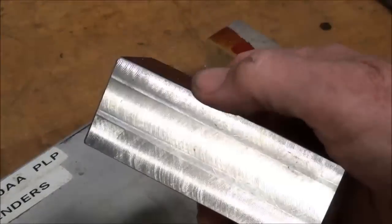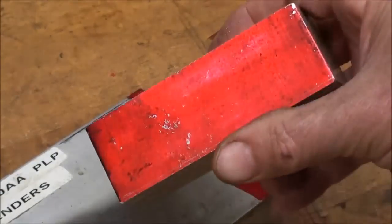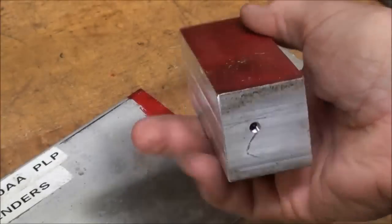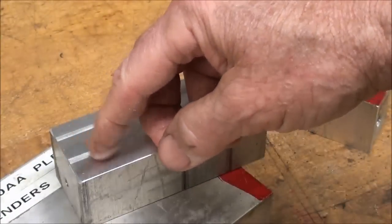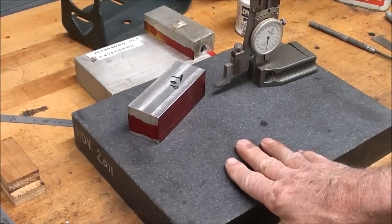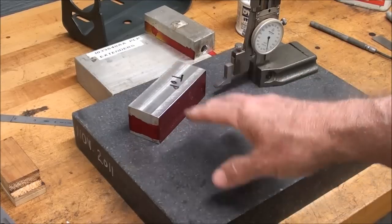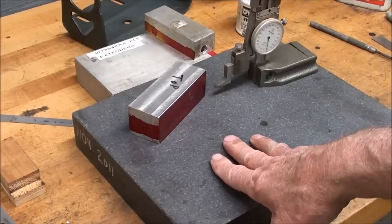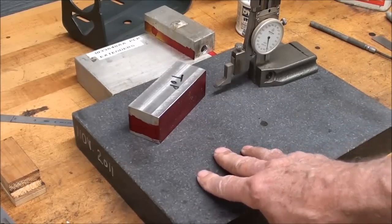And I've already milled both sides just to clean it up, get rid of all the saw marks, and just take it down to a nominal width. Now I'm going to lay it off such that I'm ready to mill the, not slots, but the notch in it. The bed ways on my Atlas lathe are 500 thousandths thick, that's a half inch, but not all Atlas lathes are the same. For instance, Bob Bigelow of Cody, Wyoming has an Atlas lathe that has 3/8 thick ways, so be sure if you're going to make one of these that you measure that.